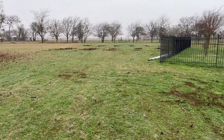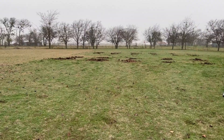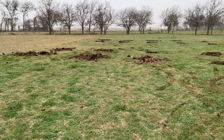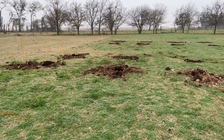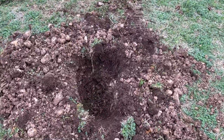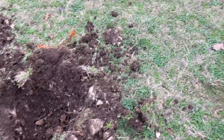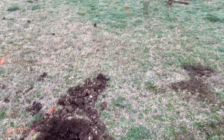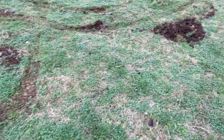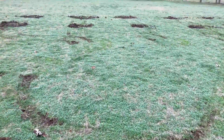They didn't get too far. They started to dig holes with the machine but it hit a lot of rock, so they took it away to get a bigger machine. Some holes went okay but others they didn't get very far at all. If you just put the post in concrete at that shallow depth, with the amount of wind you're going to get for the size of these structures, they'll just blow out of the ground. You need to get these things pretty deep.